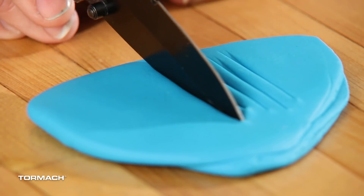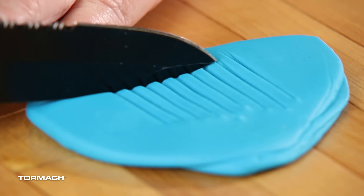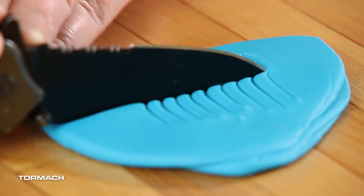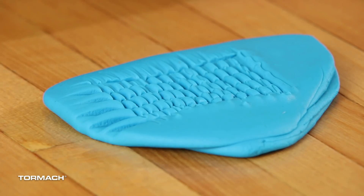I really don't like rotaries because anything floating around in the environment is going to get sucked down into your work. The real enemy is heat and pressure. When you're using more aggressive cutting, you're pushing forward and also heating up the material. That material is not snapping back, so when you go the other way you're actually creating small ripples. The ripples compound upon each other, and as you move in the other direction you start ripping off the crests of those ripples, creating an orange peel effect — small pits that make the surface look like an orange peel. It's very easy to eventually damage the material.